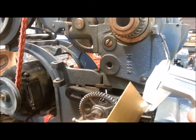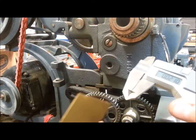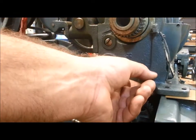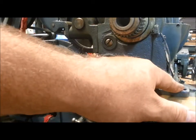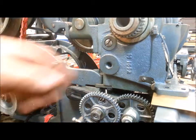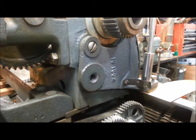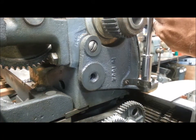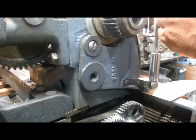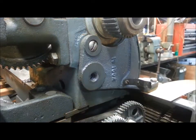Here's a piece of shim stock — seventeen thousandths. I've just thought of a quick way to test this. I can put the shim stock in here and snug up on these bolts, snug up on this bolt, assemble it and see what kind of play we have. Now let's watch what happens here when I snug up on these bolts — did you see that? See it raise up. I'm just going to lightly snug these. That should have closed up our gear lash.